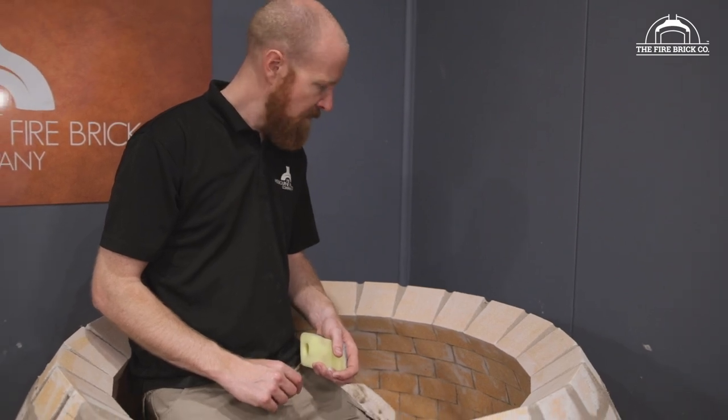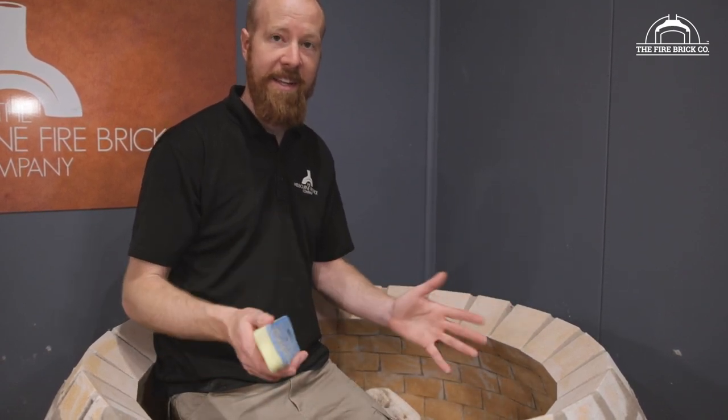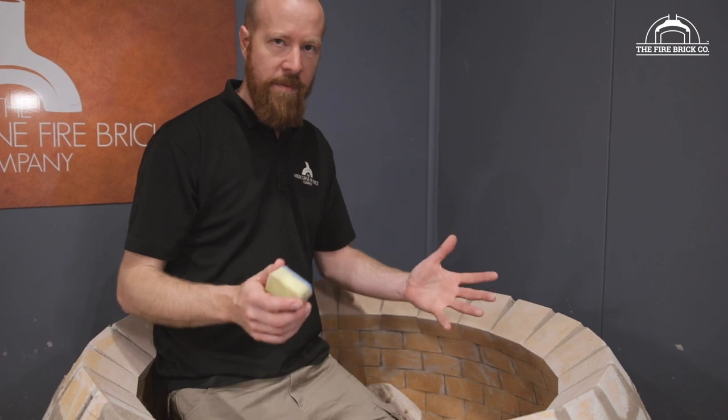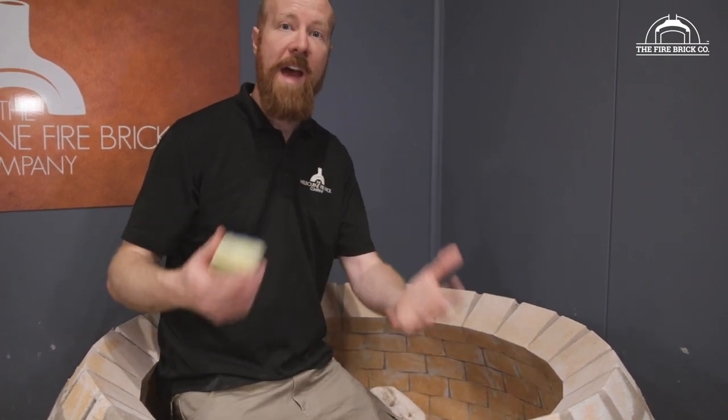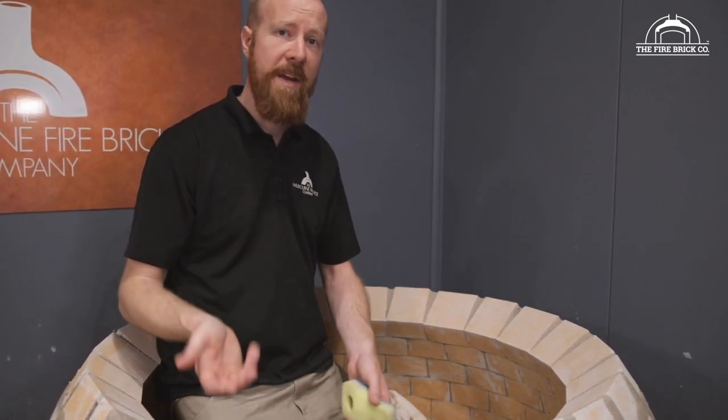next row of bricks. What I'm using to clean the bricks, I mentioned before, the scourer, just using warm water. I'm not using any detergent or crazy acids or anything like that. I am just scrubbing with the scourer. We do get asked from time to time, oh, can I use acid? Because acid's often used for cleaning brickwork in housing. It's not something that we recommend.